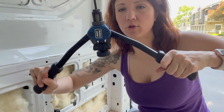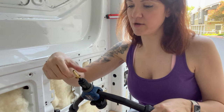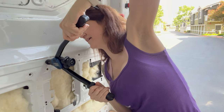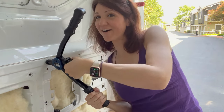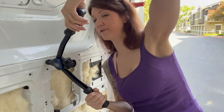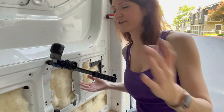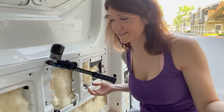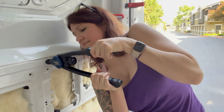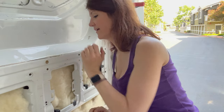When you put on the plus nut, you want to pull the handles all the way out first, then thread this down on top. I'm just going to stick the whole thing in and then clamp it down. Now since it has crimped a little bit, the plus nut is a little bit shorter so I can actually get this a little bit further down. I'm going to crimp it again — and you'll notice I can actually let go of this. It looks like for that one I did have to tighten it three times, and that last one was a little bit tougher, but that is in there and ready to go.